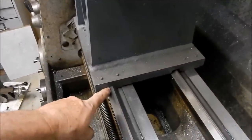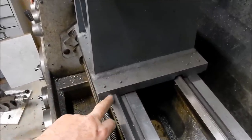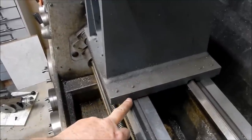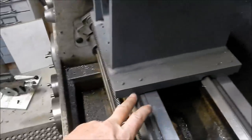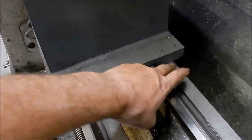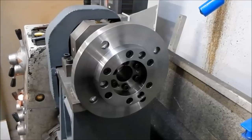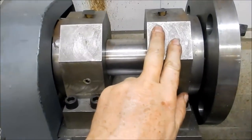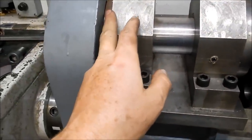Notice too that I've actually made up matching way grooves to match in there. I've done them in what I call cartridge design, where it's an insert that bolts in there, so it gets machined up separately. Once the datum points are known, then you can do the final cuts. This side here, he sits on the prism, he sits on the flat. These bearing blocks, I've got the Timken taper rollers inside these with the nut and the locking washer, just to set the tension on this.